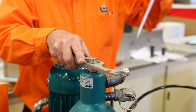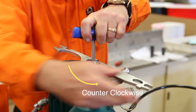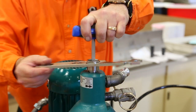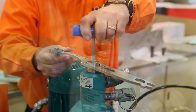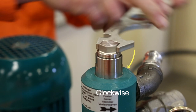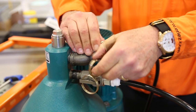Place one multi-tool over the handle connection piece and insert the T-wrench down the inside of the piece. Hold the T-wrench steady and move the multi-tool counter-clockwise. The handle connection piece screws into the centripetal pump and holds the pump inside the pump chamber so that it does not touch any surfaces. Install the pipe plug on top of the connection piece and tighten to just snug. Re-install the hoses to the hood using the CamLock quick disconnect fittings. The unit is now ready to be put into service.